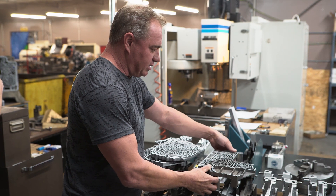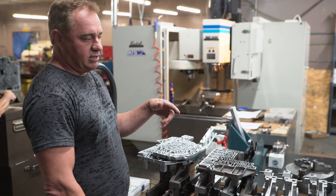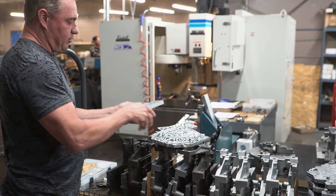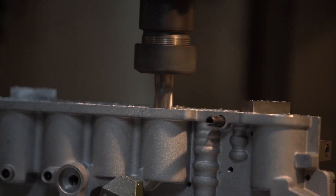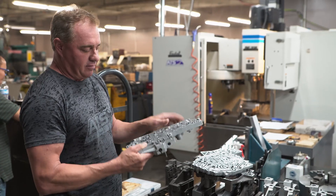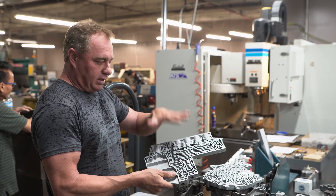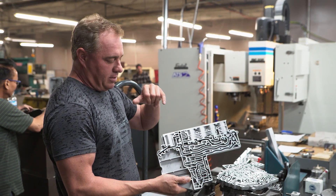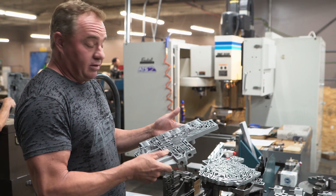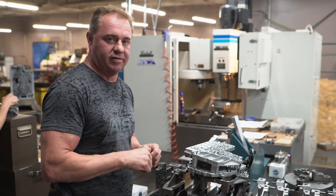So that's just a little tidbit, one of the things we're doing today on our milling machine. We've got about a hundred valve bodies here — machining all the surfaces, then we'll turn them up and take care of all the accumulator bores, oversize them, cross-hatch them, take care of the main valve and the lockup valve, put the steel valves in, and then you'll have a valve body assembly that's completely machined with upgraded accumulators, upgraded spool valves, all put together with the thicker plate for higher pressure. Then you have a complete valve body assembly, ready to roll for any upgraded 68 RFE.